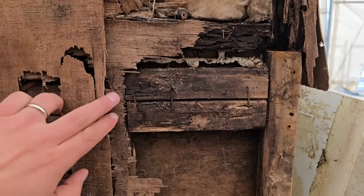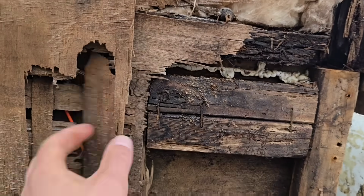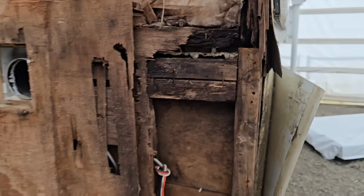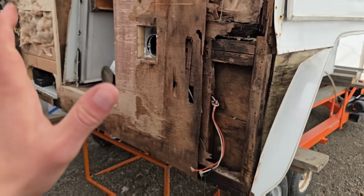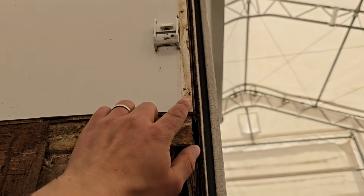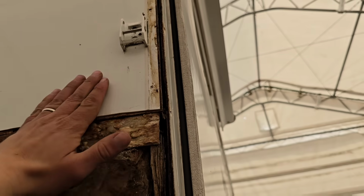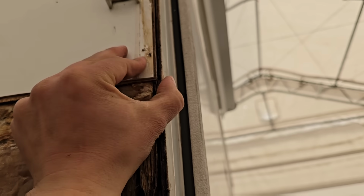And then look at this. These joints all coming in here, none of them actually have any kind of strength to them, right? None of them do. They have nothing that held them together. And so these things, they rip themselves apart because of all that movement that's allowed in the structure. It rips itself apart. And then on the corners, it fails in the corners because of all that movement, right? And then you have what we call a butt joint, where this comes over and butts to this one. Look at how much space there is there.